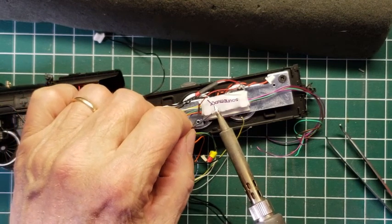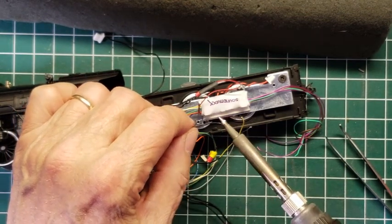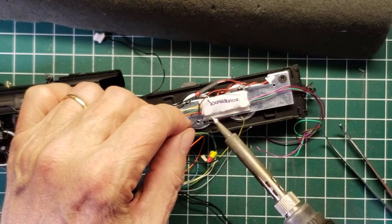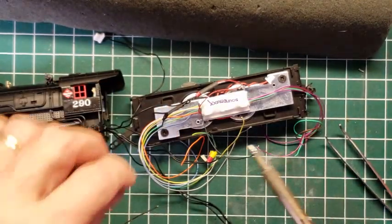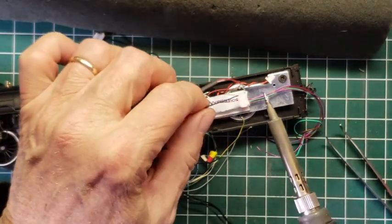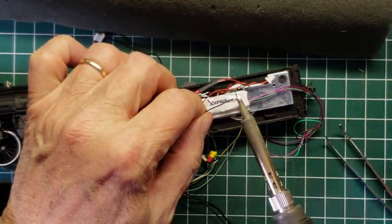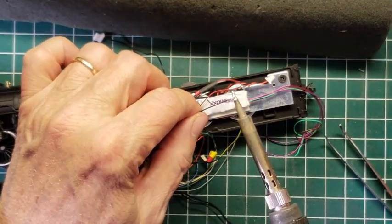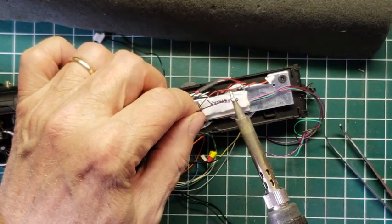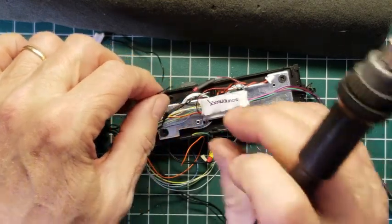Oh, that's the other thing too: if you've got your wires tinned, they go together quicker, faster, right? Because they've already got solder on them. You've already made sure that they will solder. In some cases like this one, we're going to almost preheat it too as we're going. That makes them solder faster.